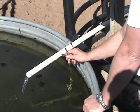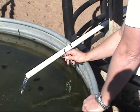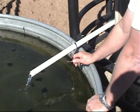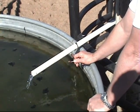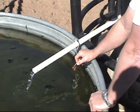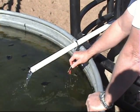Should you need to go further than that — if it's further than 20 feet from your unit to your tank — then you can splice on a light gauge, 18 or 20 gauge wire, to make it reach further than the 20 feet that comes standard.